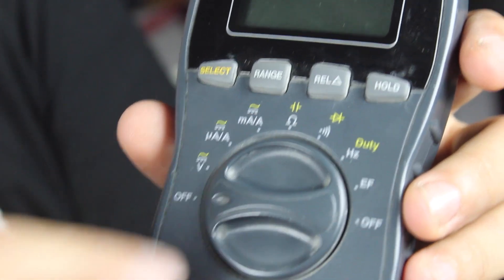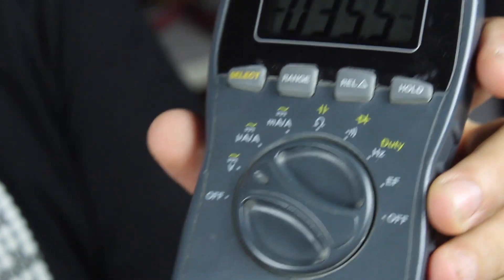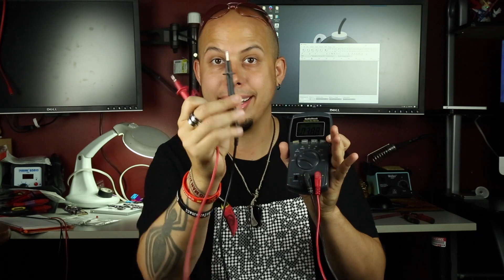So in order to do that I will get my handy multimeter out, I'll look for the V and click it on there, and then with these two leads — my black one going to my negative, my red one going to my positive — I can actually probe my circuit to make sure that I have the voltage I expect.